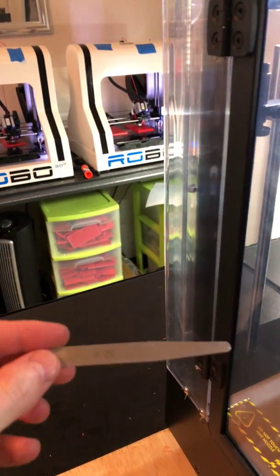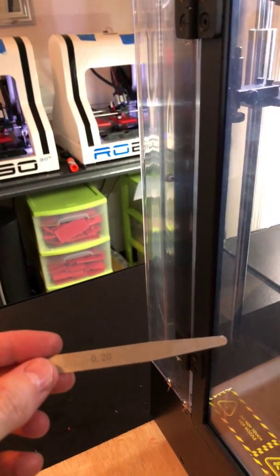First issue I had was with the Z-Rod. I was trying to adjust to get the level set to the recommended 0.2 between the extruder and the bed, and I loosened that little bolt and the whole sucker fell down, so I had to try to get that set right. I finally figured it out with just a little bit of reading of the owner's manual.